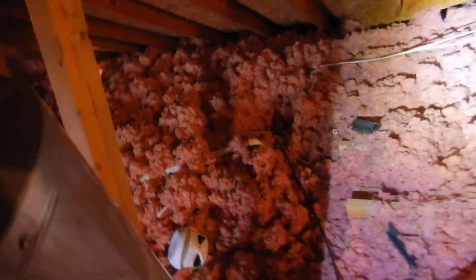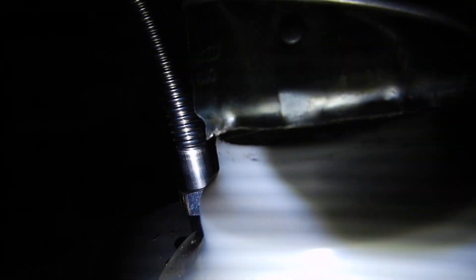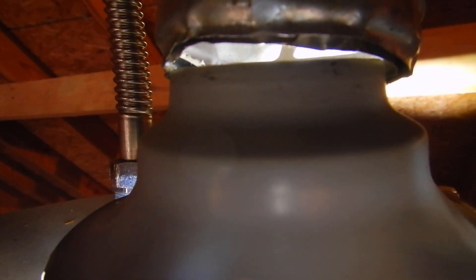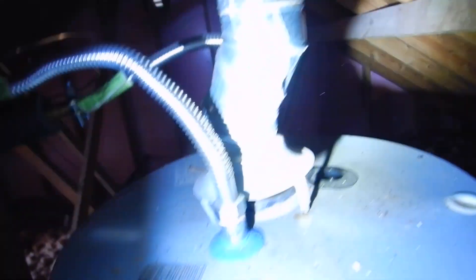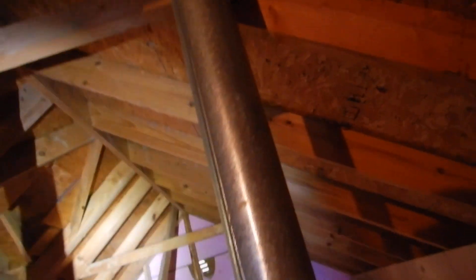What I'm not seeing: care and use manual. Insulation should go down to the tank. The draft hood doesn't fit right — in fact, there's a hole right there. Think carbon monoxide can get through there? I do. This pipe — I know it's a short run, but it's supposed to be stabilized. It's supposed to be secured in the attic. It's not secured either.